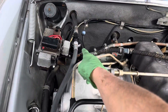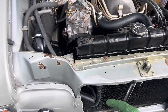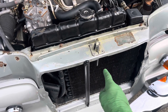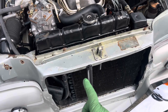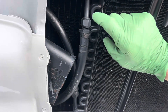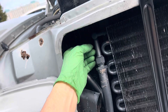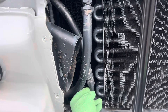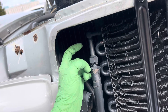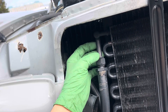I notice they have a new dryer on here, so somebody has worked on it before. Something else I noticed: if this had an electric fan, there needs to be a way to activate it. Some of these old systems had an add-on temperature switch with clamps that would clamp right onto the line — I would put it right here on the hot gas discharge from the compressor, where you have the highest temperature.